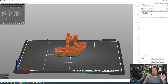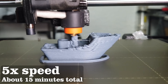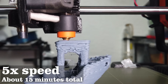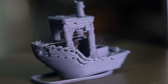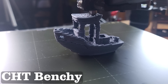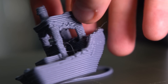I'm most interested to see what this Benchy looks like — so let's go run some high flow models. An 11-minute Benchy. One-millimeter thick layers. Far from perfect, but that is bone stock settings at 225°C on the nozzle. Revo High Flow is something crazy. The only way we've gotten this close is with the 1.8mm CHT, and that Benchy doesn't look nearly as good. Bottom layer's dead flat because of how thick the layers are. A little bit of stringing, and the overhangs are not great.